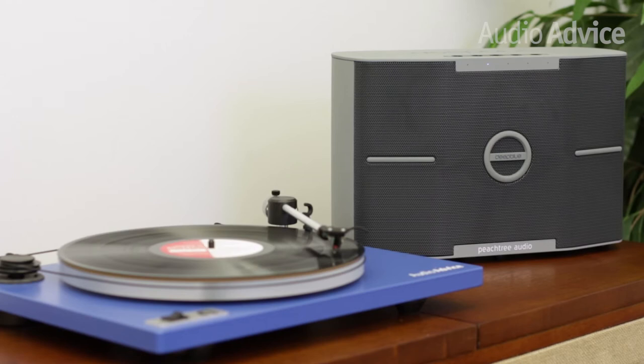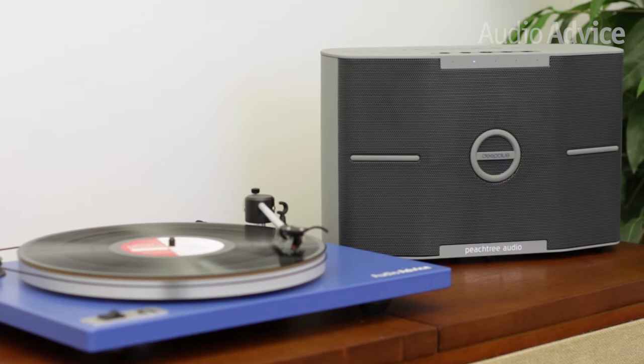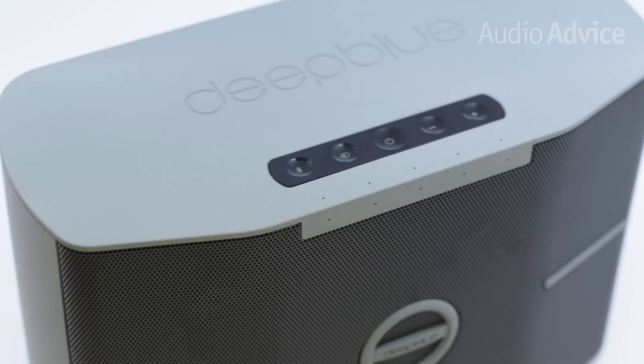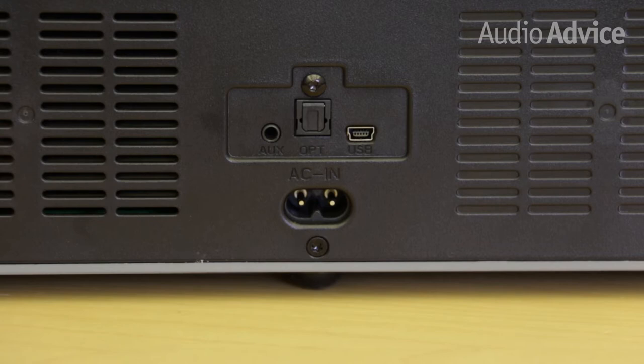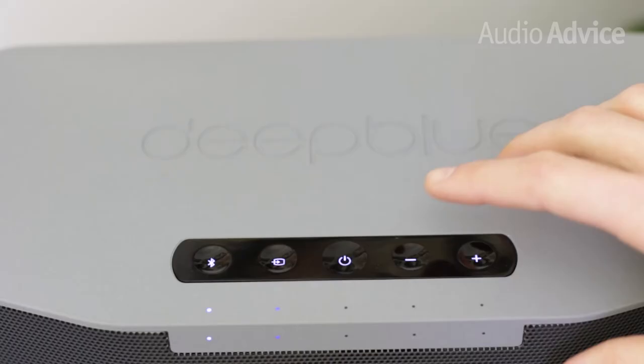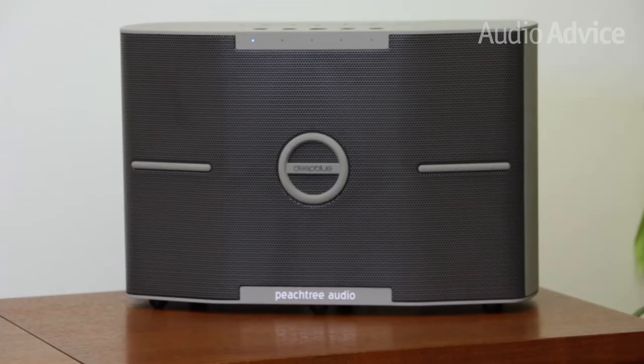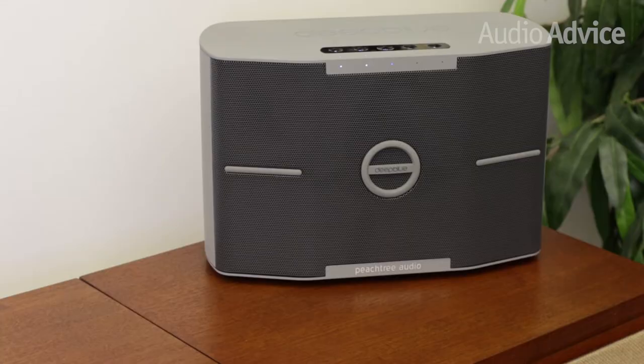The Deepblue3 also includes 2 3-inch mid-range drivers, giving it some great response for the critical mid-range frequencies, along with 2 1-inch soft dome tweeters for the highs. The total amp power is 440 watts, with each driver having its own amplifier. The Deepblue3 also includes a feature called Smart Volume. This adds some bottom end fullness when you're listening at low volumes, and slightly rolls off the audio peaks at high volume levels, allowing the speakers to play loudly for hours without strain and distortion.